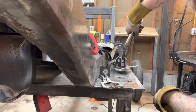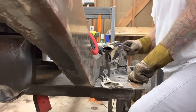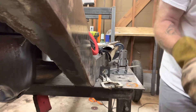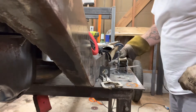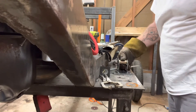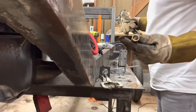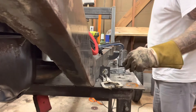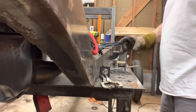Nice and straight. I'll show you — this distance was determined by the steel bushing that goes inside. One ear on this side is folded outward, I have to knock it around, but it's not a big deal. The steel bushing is the center of the entire engine mount. I've misplaced the rubber portion, but that's what this distance was determined by.